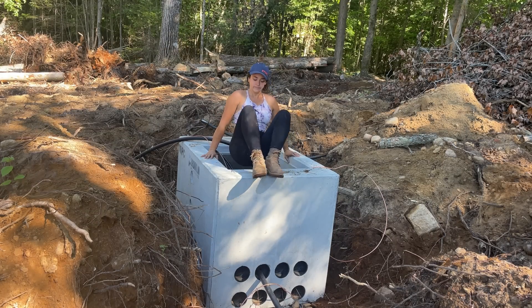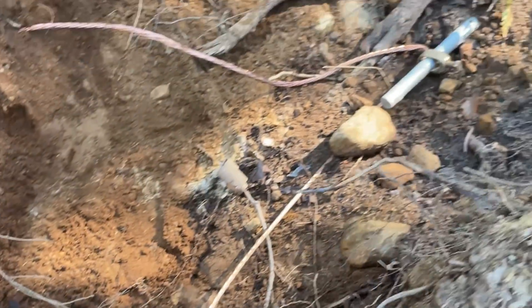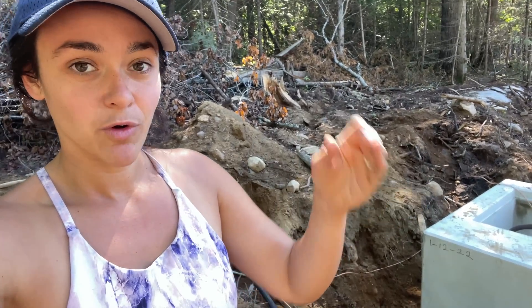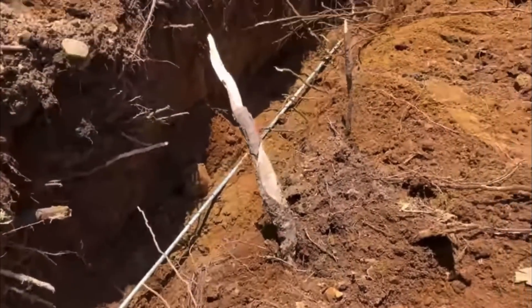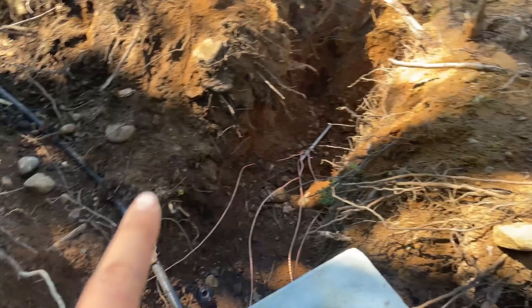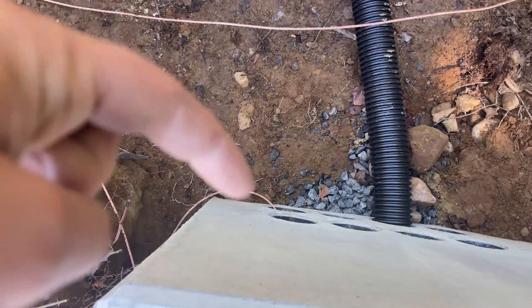Time to work on the grounding grid around the transformer pad because I totally messed it up the first time. Basically, this is a grounding grid — we have a grounding rod on each corner that's three feet out. Traditionally you hammer grounding rods vertically, but because our area is full of bedrock, a lot of times grounding rods get installed horizontally. The only rule in our area is it has to be two feet under. So the copper goes from the first rod to the second, to the third, to the fourth, back to the first rod. It gets connected at two points because there's our side and then there's the company's side.